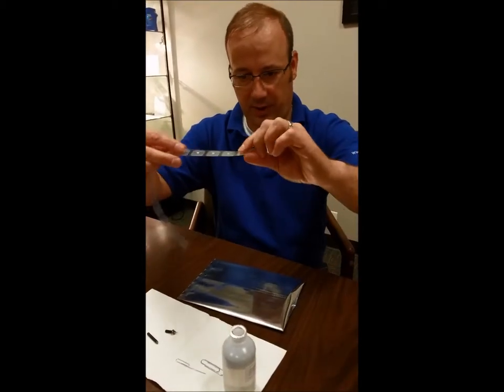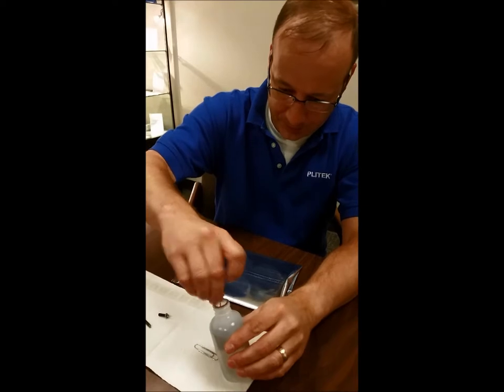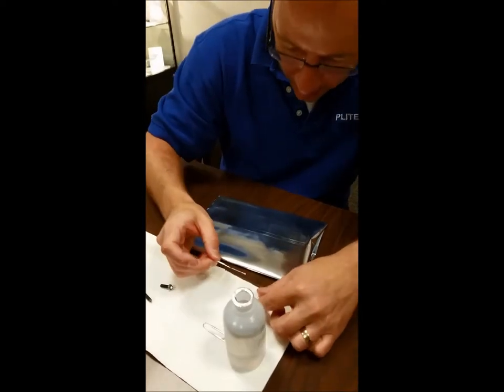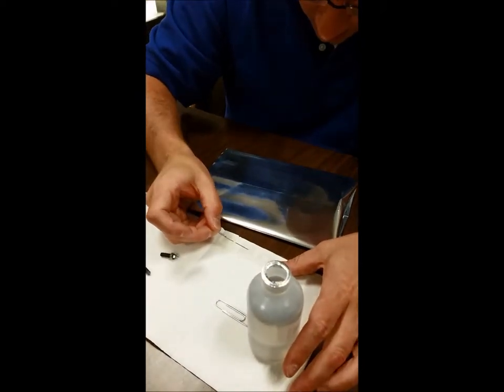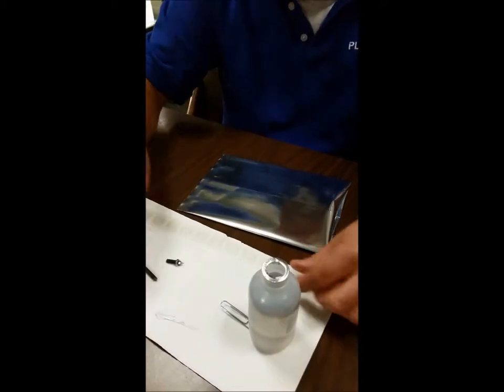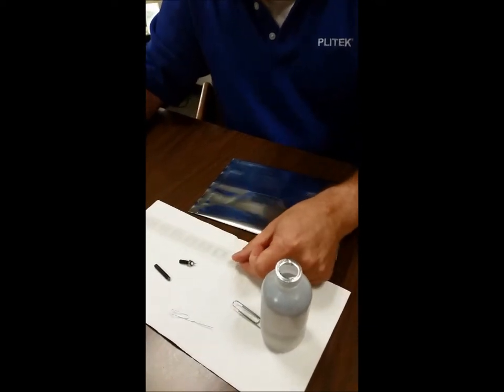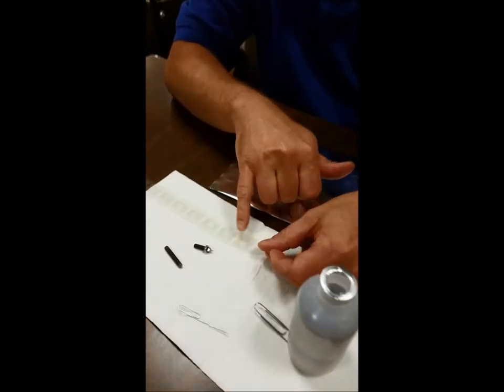Again, we're dealing with the liner side of the valve, not the side that the valve is on. We're going to pick up our oil — I got my first drop, I wipe it away. I just oiled three valves. What I'm looking for — and the more you do this the better you'll get — is you're actually going to see that oil start to migrate into what we refer to as the dry strap region of the valve. One of those layers is the base of the valve; the other one is the dry strap. We're looking for a migration of that oil into the dry strap region.